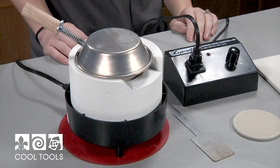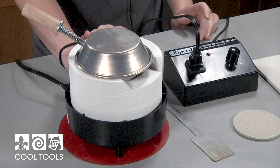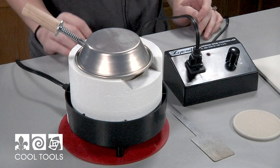These little kilns are great for firing precious metal clay and enameling, which I'm going to show you today, but they can also be used for kumboo, fine metals granulation, and fusing glass. In this video, I'm mostly going to be working with the Studio Kiln, but it works basically the same as the Beehive. The only difference really is that this kiln can reach 1600, whereas the Beehive maxes out at 1550.